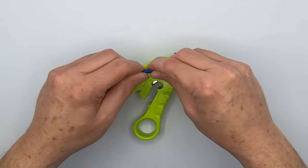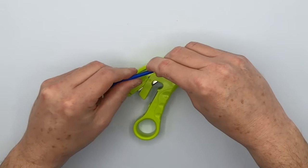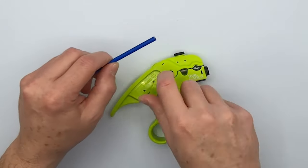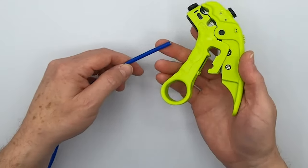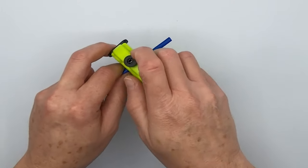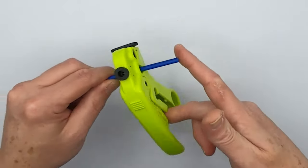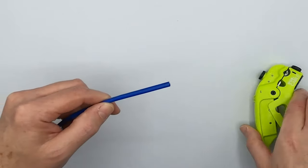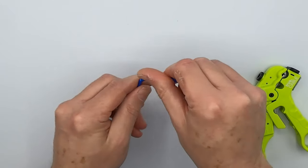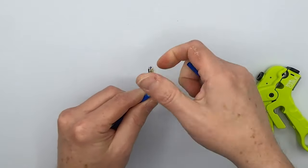What I do is roll it like this to get it as circular as I can, because a spline adds more work but actually makes the cable more circular. In the case of Cat5e though, it's not as circular as it should be, but it's plastic after all. Raise your blade on your tool all the way up, put a couple of inches through, and then lower it down until it just makes firm contact with the cable jacket. Then turn once or twice and you've got a nice score on there — you can actually hear it pop. Then pull off.